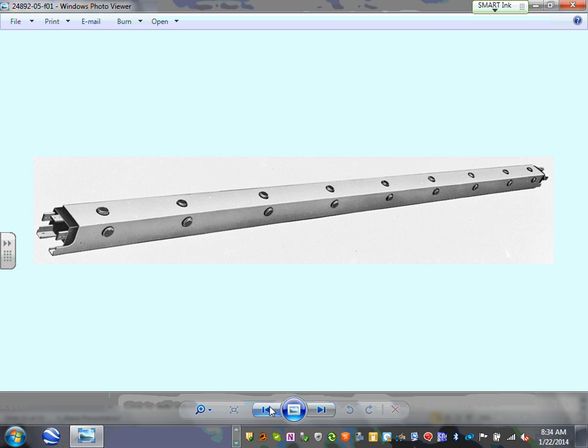Any comments, guys? Any questions about the trolley busways? All this, Matt, everything that we throw at you guys is for one little reason. As you go in the field, an industrial manufacturing floor, you want to provide the better solution for a power system for this area. Here's another option. Does that make sense? Feeder busway, plug-in busway, and now a trolley busway. These are your solutions for an industrial manufacturing floor. So that's all about solutions. The more you know, guys, about solutions for problems, the better designer you will be. So, comments, questions, my friends?